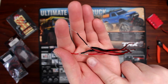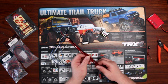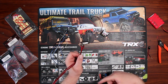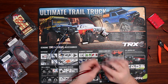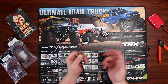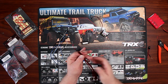You can see the resistors right here. What the resistor does is downgrade the voltage, because physically these LEDs are not six volts — they're probably three volts. If you overpower an LED it's going to light up super bright and die, because it is a diode. With this resistor, it reduces the voltage, lets the LED light up, and the extra voltage is dissipated as heat. After these guys have been running a while, if you touch the connection you'll feel some heat — that's 100% normal.